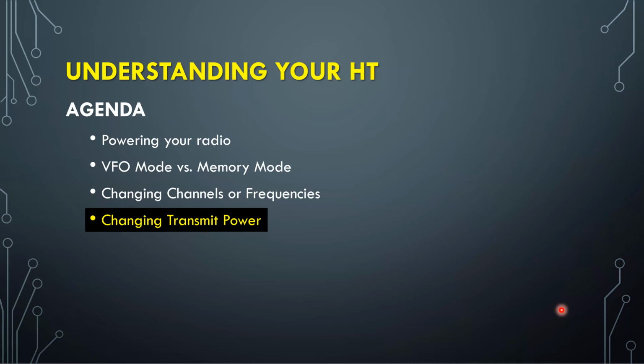Yeah. There's ways around stuff, but a lot of the clubs, we have to understand the limitation of what radio signals can do. And the frequencies that we're using on the HTs, the 2 meter, the 1.25 meter and the 70 centimeter, they typically don't do a good job of going over mountains, over large hills. Sometimes they can, okay? If you get 6 meter or 10 meter communications, that tends to propagate a little bit better. It uses ground wave, but that's another discussion, okay?